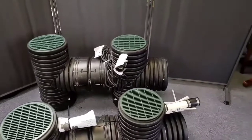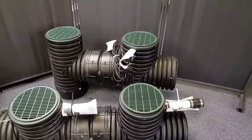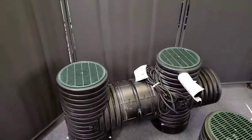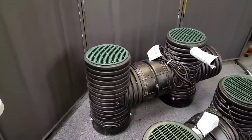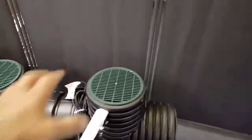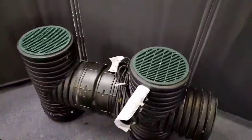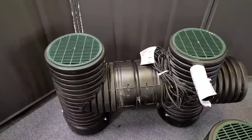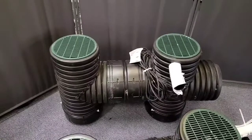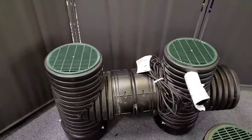But we're rocking two half-horsepower sump pumps. So the Screamin' Demon micro with the two half-horse — this is the baddest thing on the planet. This is the latest and greatest. We have inlets for the top, inlets for the sides. We drill half-inch holes all throughout the housings so that with two half-horse pumps, we want the water to flow into this housing as fast as the pumps can take it out — which they do.